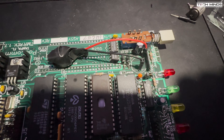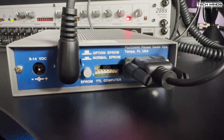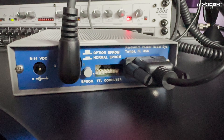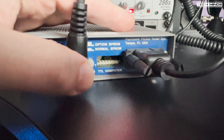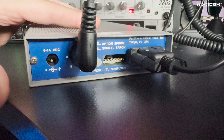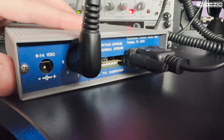I am in range of a BBS which is still active today, so I wanted to see if I could get the Tiny2 working with my Yaesu FTM300 radio. The first thing to do is change the internal battery. Although I can use it without the internal battery working, it saves having to re-enter all the settings every time I turn it on. Removing the old battery was fairly easy, but I noticed the mounting lugs appeared to be welded onto the battery. The replacement 3V lithium battery from Amazon did not have these mounting lugs, so I opted to solder a couple of wires onto the new battery, cover it in tape, and then solder the wires to the main PCB — not exactly a neat job, but it works.